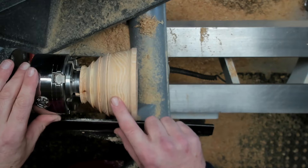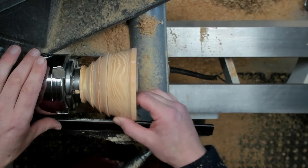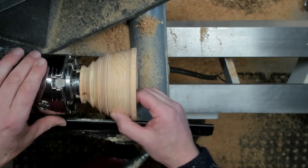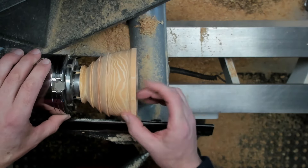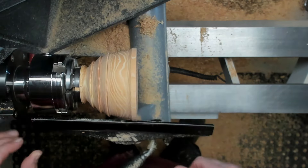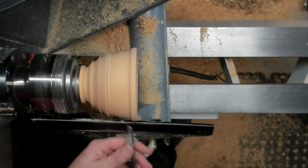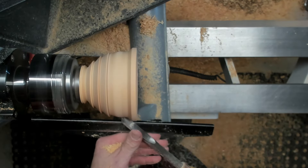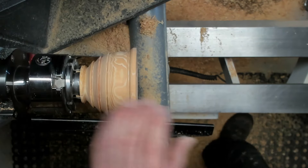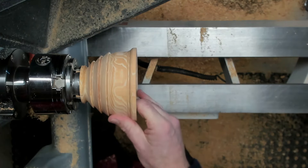At this section here I want to drill an entry hole so the birds can get in. This is going to be just for the small native ornamental birds we have here in Ireland. They're very small, so something like a 30mm hole would be quite sufficient. But I might just take another little bit here just to flatten it off a bit. I'm happy with that, so I'm going to drill the hole while it's on the lathe where I can lock it and have it secure.